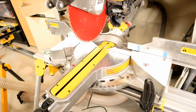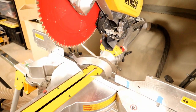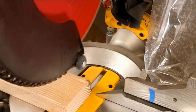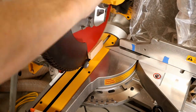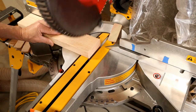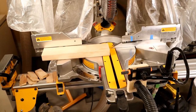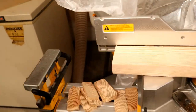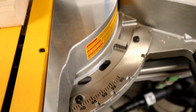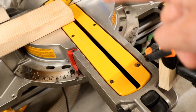You can see it connected to the blade here, and as I lower the blade the air pushes it directly toward the exhaust port of the miter saw. I also wound up hanging some clear plastic on either side of the front of the hood. Now I'm making the series of cuts — notice as the pieces get cut off how they get pushed toward the rear toward the exhaust port. Here's one in slow motion, which really dramatizes this effect. See how that piece gets shot back there from the force of the air. I blew a circuit breaker at cut 13, went and reset it, and now I want to show you the dust left behind after 13 cuts.